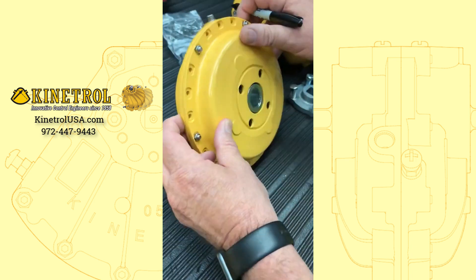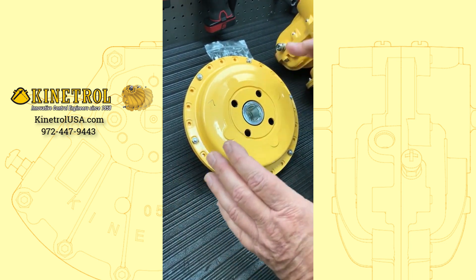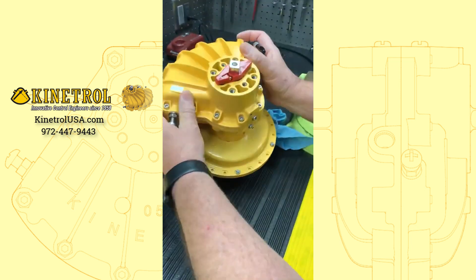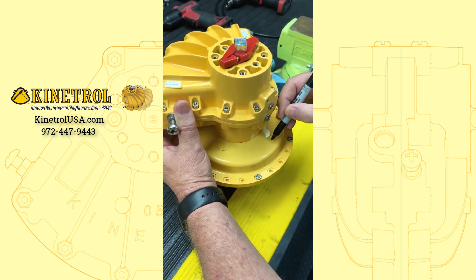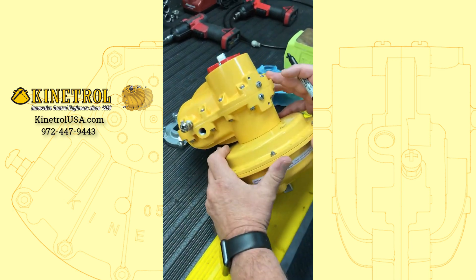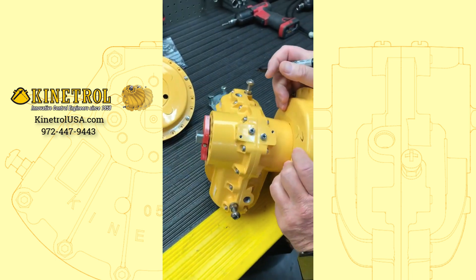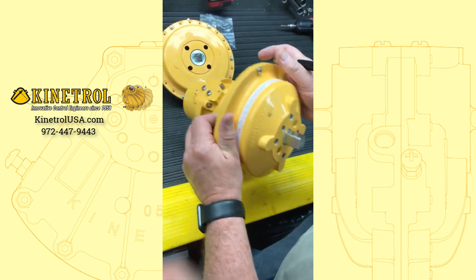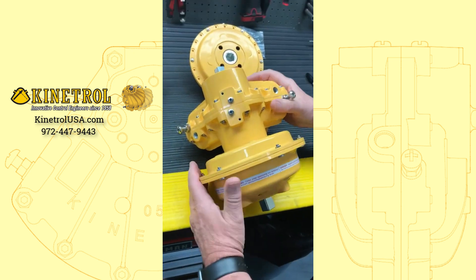There's usually an arrow on the side of your spring, but just for instructional purposes I'm showing this so you can see that as we look down from the actuator side of the spring it's actually going in the clockwise direction. So here on our 097 120, looking down on our spring, our spring is going to be going or failing in the clockwise direction. Whenever we pull the spring off we turn our actuator upside down — so here the spring appears to be going anti-clockwise, but it's still going the same direction. That's where some confusion comes in as to which way you look at your spring.